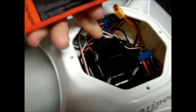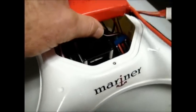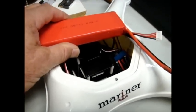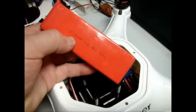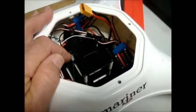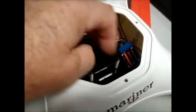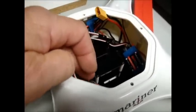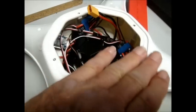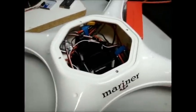In the factory setup we were limited by battery arrangements. The typical battery provided was a 2500mAh 4S 25C pack. That was extremely difficult to fit because the NAZA plate blocked transmission wires for the diversity antenna of the receiver. You could go up to a 3300 or 3400, and that was the maximum that could fit. So one of the first things I did was modify the Mariner by removing the center plate — just four screws from the top back plate, then snip the white legs off to the side with a Dremel or small snips. That leaves you with a nice flat bottom and an empty cavity.